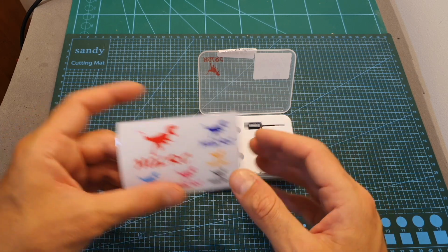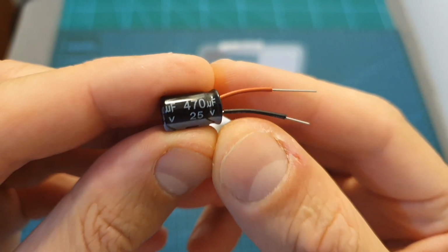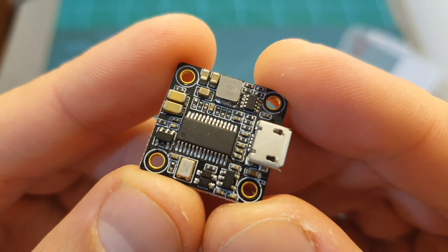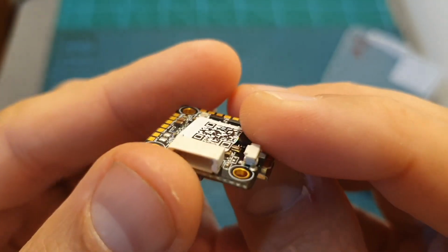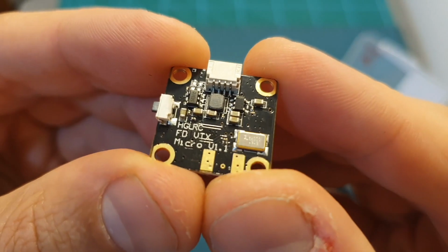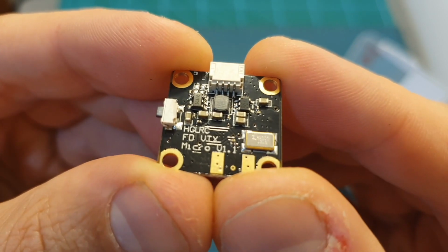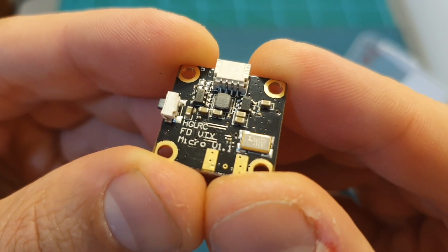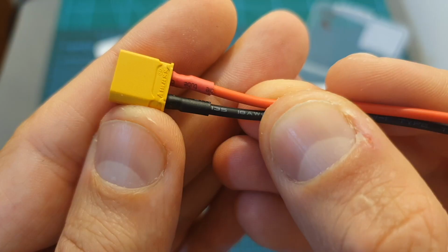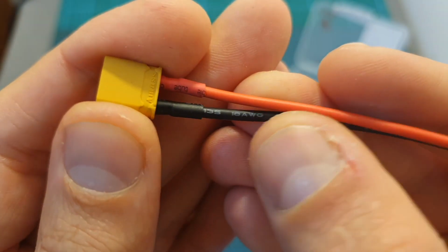Inside the box you can find first of all some stickers, a 470 microfarad 25 volts capacitor, a 13A BLHeli 4-in-1 ESC, an F4 flight controller which comes pre-flashed with Betaflight 4.0.4, a 48 channels VTX that supports smart audio using IRC Tramp protocol. It has a selectable output strength of 25, 100, 200 and 400 mW and it's using an IPX antenna connector. In addition, you are also getting a high-quality XT30 battery connector, which is pre-soldered to 16 AWG battery leads,